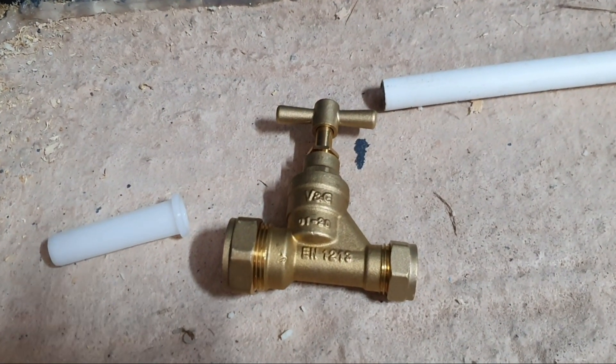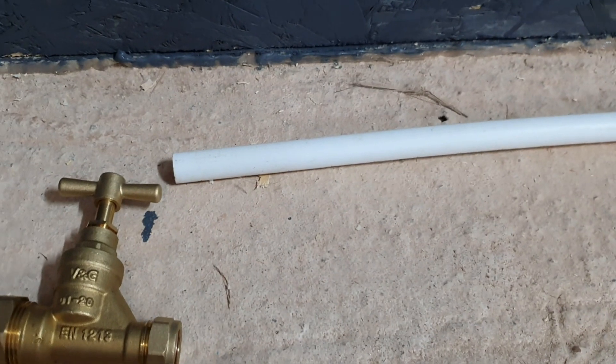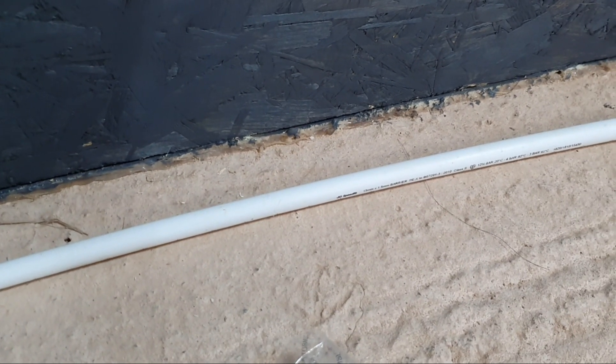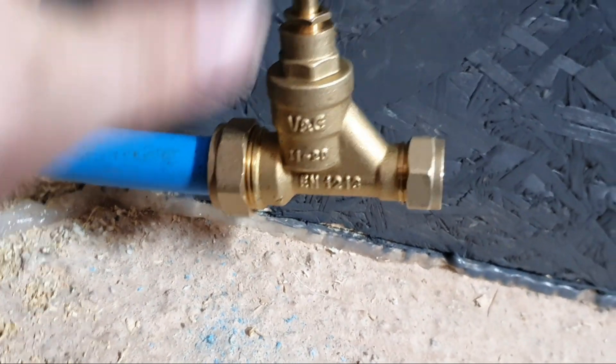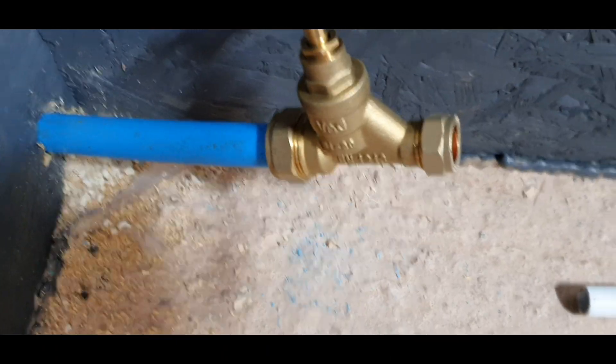The next stage is getting the water from a 20mm mains pipe down to a 15mm pipe for the internal water supply. To do that I'm using a reducing stopcock, which will allow me to turn the water off inside if I need to, and also reduces it down to 15mm. The reason I'm reducing to 15mm is because I want an RO system feeding from this, and I can't find an RO adapter that works on 20mm pipe — most RO water adapters run from a 15mm pipe. The stopcock is attached, I've used some plumber's tape for a good seal. We turn the pressure on with this turned off — no leaks whatsoever, works flawlessly.